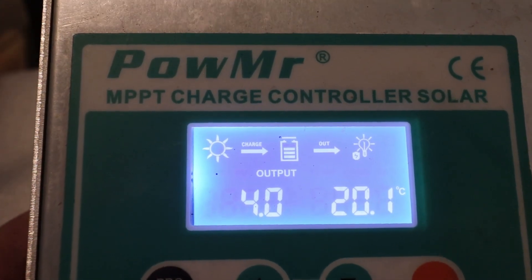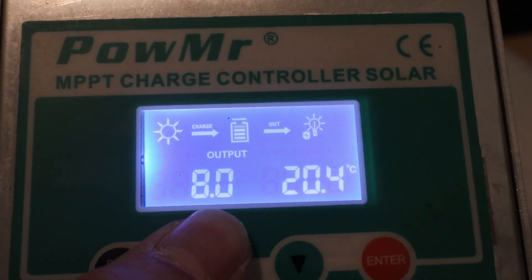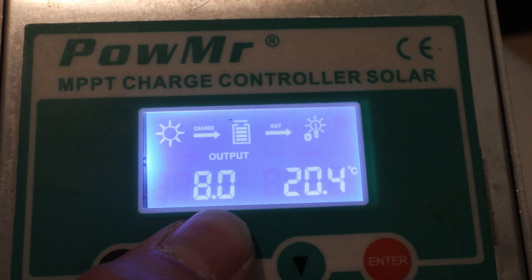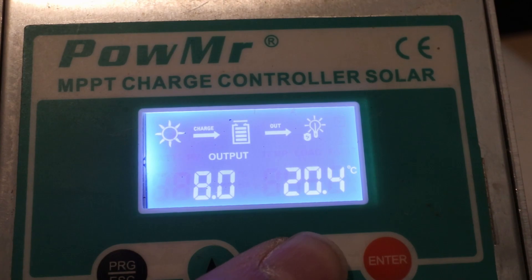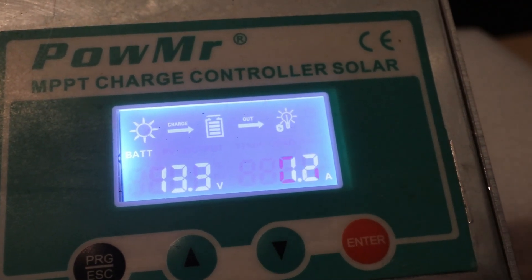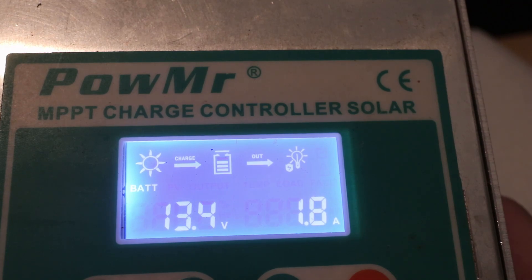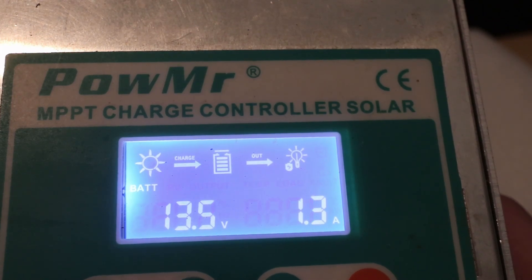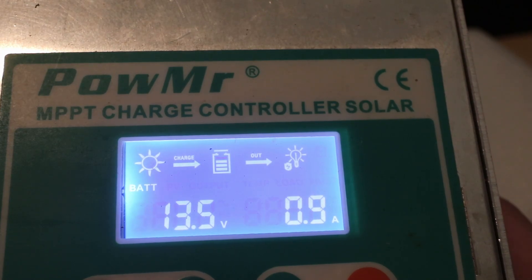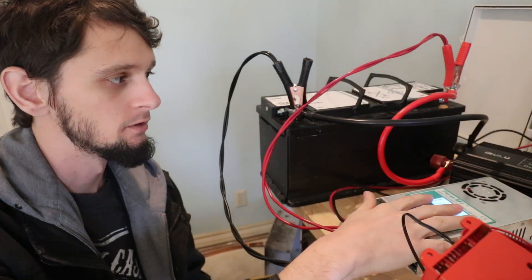So here we are at four — and in this case it actually skipped seven. I know it does typically sit at seven. This battery only has about 250 watt hours available, even down to about 11 volts. It's a very old used up battery, so that could just be causing the issue. But I know there is an absorption mode. So at 13.1 volts, it should get all the way up to 14.6. Climbing right up to 14.6 — and then it goes ahead and drops back down to 13.5. It must have some sort of calculation for how long to stay in absorption, and for whatever reason with this battery it does not stay there very long.